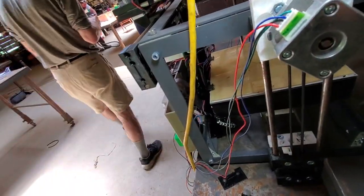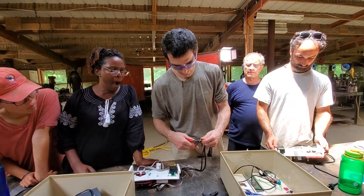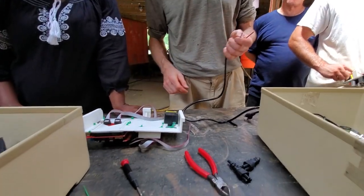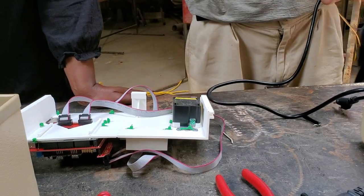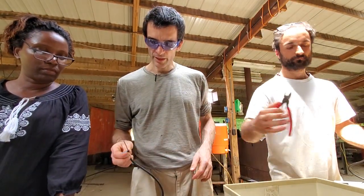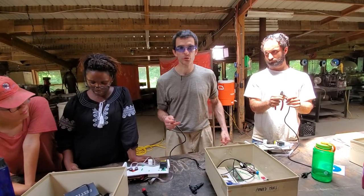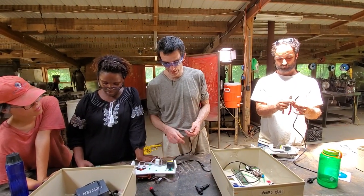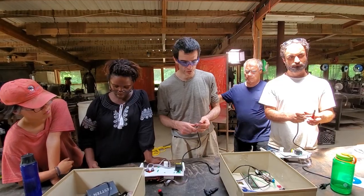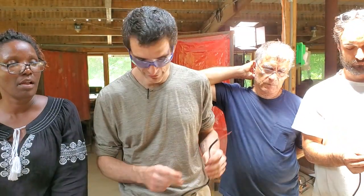The blue is on. You don't have any ground on there. So we need to strip this one now, and we've got the wire strippers. It's red and blue that we need, and we trim away the gray wire. Strip loose strands around — you might not get them in a hole, or they might break off pretty easily, so you want to keep them together. Once we've got it stripped and tinned, we actually need to take that to the solder station and have them do that.